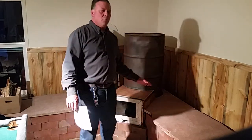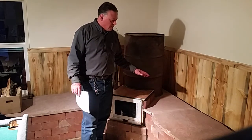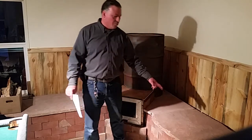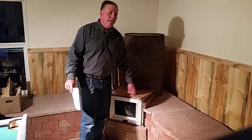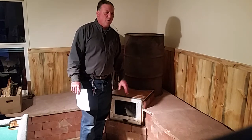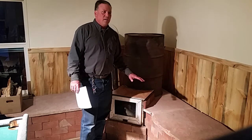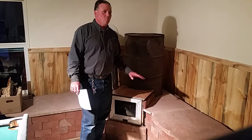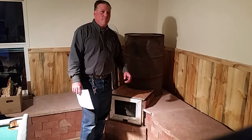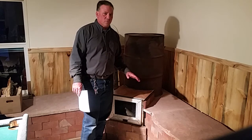When I went to sleep, the bench seat was 130 degrees — closer to the combustion chamber, about 130 degrees. When I woke up this morning it was still radiating 75 degrees. I didn't have that long of a fire going — probably around a two-and-a-half hour fire. Tonight I would probably want to make a four-hour fire and get the temperature in the house up a little bit more.